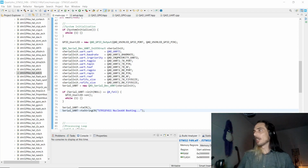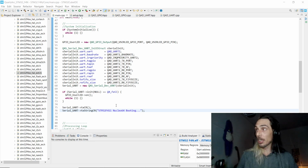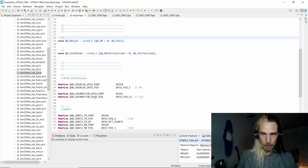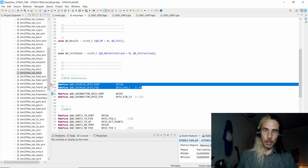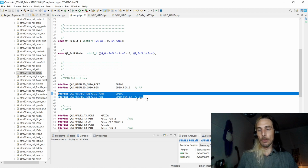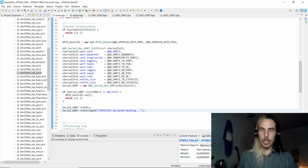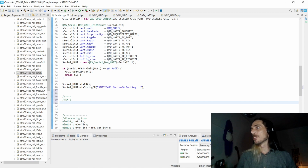which means that what we're going to need first up is the particular GPIO and pin number that it is connected to. In this case, it's going to be GPIO C pin number 13. So if we jump into our setup, there's one I've prepared earlier. Much like we did previously for the user LED in the Discovery series, I'm popping in a couple of defines just so that we've got those ready to go, to make life a little bit easier. Let's pop a comment in there just to help separate out some of that code.